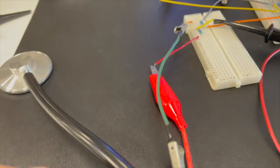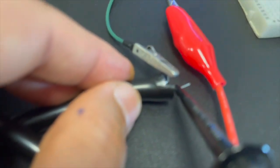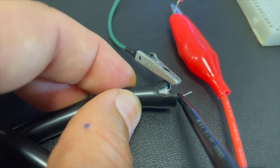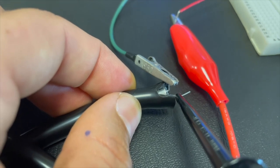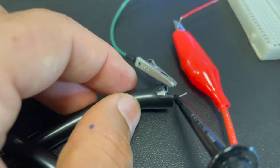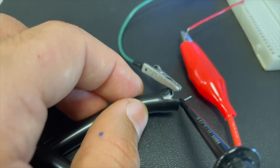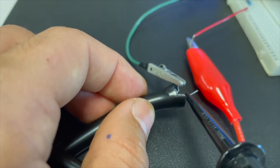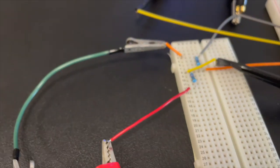Another tip is you need to make sure that the electret microphone is pretty well situated into this tube. I went ahead and just put some jumper wires, some with alligator clips and another clip to make connections, but a better way would obviously be to solder both wires on there and then have other connections into the main board there.